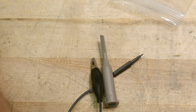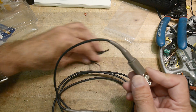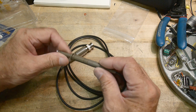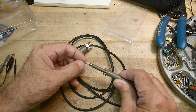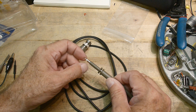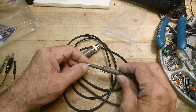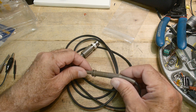Here is the probe. It is not a times-one/times-ten switch — it is only times ten, which I kind of like, actually. I don't like having a switch that I can accidentally mess up. The probe tip is fat and much more rugged than other probe tips I have. It's not gold plated, but it has some really shiny plating — maybe nickel plating or something.